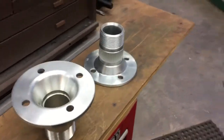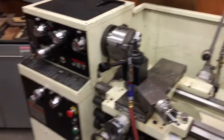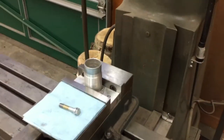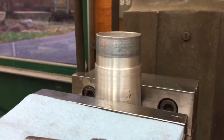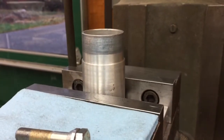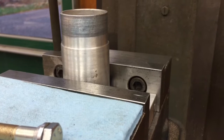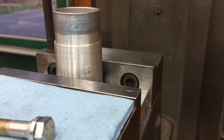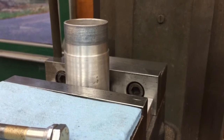The first thing we did is we went to our lathe and took a piece of aluminum pipe. We turned it down to match the ID on the part — a couple thousandths under so it would be a nice fit, not too tight to get on and off, but not much slop. It sits nicely and sits flat down on the jaws of the chuck. We're going to put a couple of shims in there so we don't drill into our chuck.